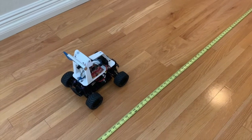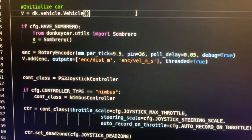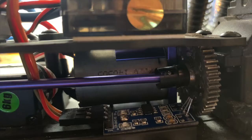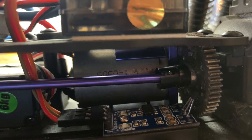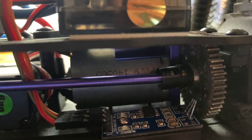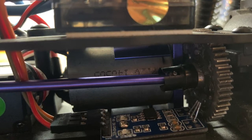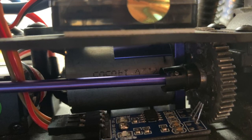Here I just measured out a distance on the floor and you drive your donkey car or whatever you're using. If you're using Donkey, here's the rotary encoder part — you can see the millimeters per tick. I arrived at 9.5, but what you'll want to do is set debug to true on the end there and continue testing. As you run it, it will spit out the distance that it's predicted, and once you're getting predictable values you should be good to go. I hope that was helpful — if you have any questions, the best place to reach us is on Slack at donkeycar.com.